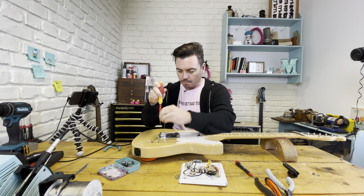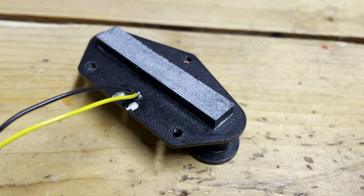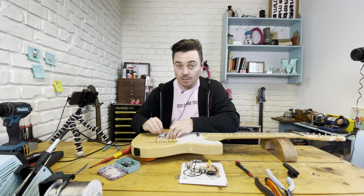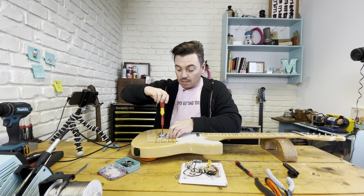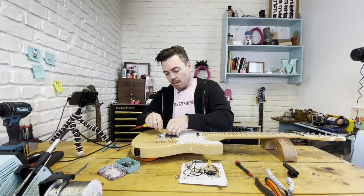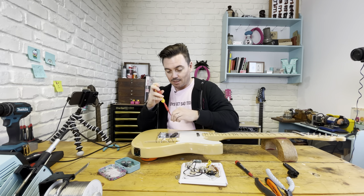Fortunately this one doesn't have a base plate because it's got a big old ceramic magnet on there and there ain't no space. Pulling out the string ground - the string ground's the wire that links the metalwork on the guitar to the electronic components and then ground. That's why you'll hear on single coil pickup loaded guitars - it does happen on humbuckers too - there's always a slight hum and when you touch the strings it deadens down, doesn't completely go away, but that's why. It's because of that little wire.